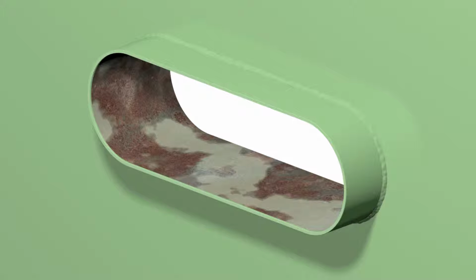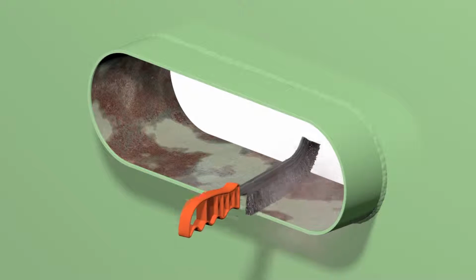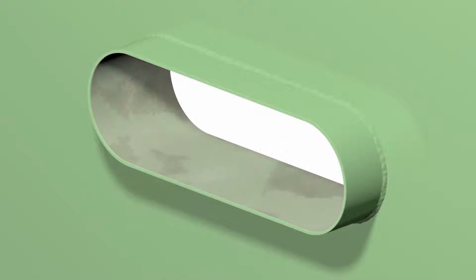The ideal transit frame for a NOFIRNO penetration is clean and coated on the inside. However, transit frames that have been in place for a while might look like this. In that case, the inside of the frame has to be cleaned thoroughly. With a steel brush or by blasting, the inner surface of the transit should be cleaned to remove all corrosion. The excellent adhesive properties of the sealing system will be diminished by corroded surfaces.